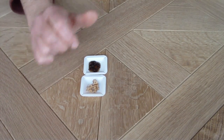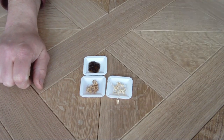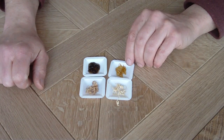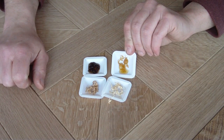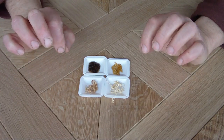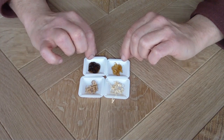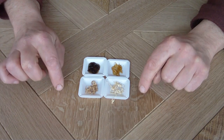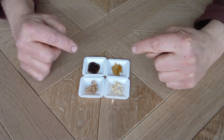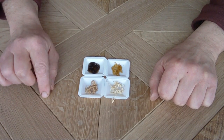By comparison, I took some red oak shavings and soaked those in the same solution, and you can see that it turns dark, but it's just basically a wet look — it's not black. So just to reiterate: the shavings have to be clean — no finish, no wax, no contaminants of any kind. Do not try to simply drip sodium nitrite on the top of a board; you'll get mixed results with that. Make sure you do the shavings in a little dish with the 5% sodium nitrite — nitrite, not nitrate.